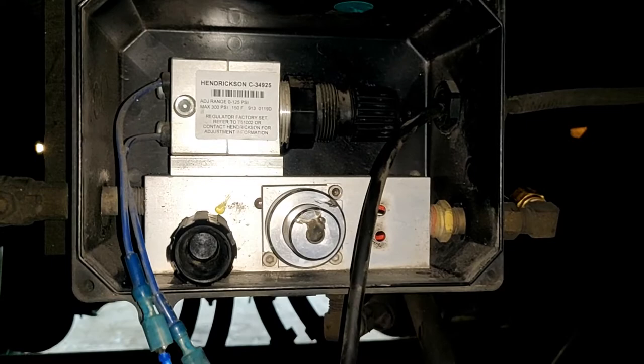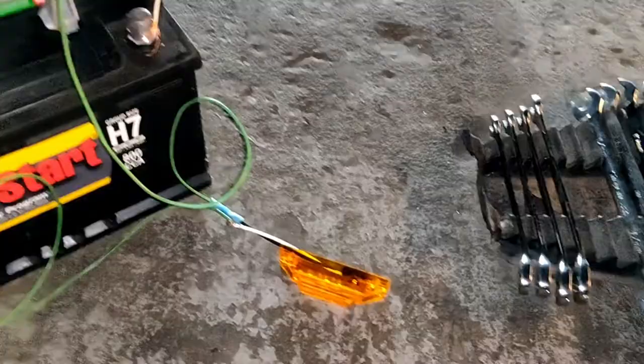As you can see, this is an air leak simulation — we have it on and off and everything is working, except the air pressure regulator on this unit. Don't forget that the light is going to show you low pressure only when the supply port is open. If you close it, the light will come on just one time, and after that even at zero pressure it won't show you anything.